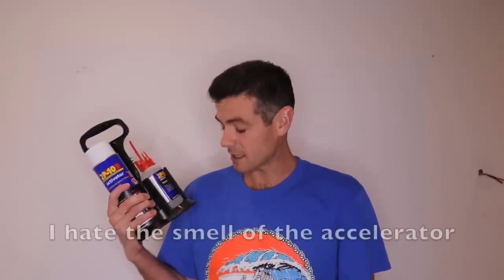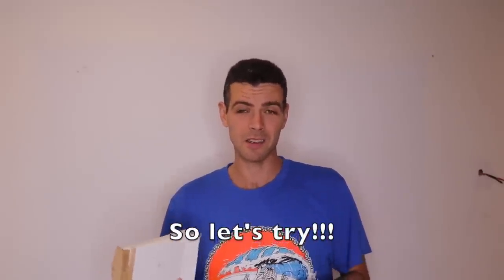That doesn't mean I'm not going to use it sometimes — I really do like doing casings this way. But I don't think I have any need to do baseboards that way. As for whether the cyanoacrylates are adequate — yeah, I was pretty happy and impressed with how they held up. But one real disadvantage is that you can't put as much glue in a CA joint, because when CA glue spills out it's super hard and you can't wipe it up with a cloth — you have to scrape or sand it off, unlike a water-based glue. So it's harder to get a really well-glued joint, though if you really laid enough in there you might get pretty similar results — but under regular working conditions it just doesn't work out that way.